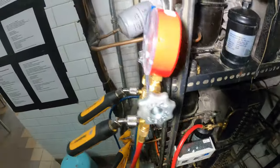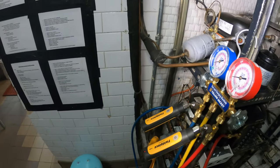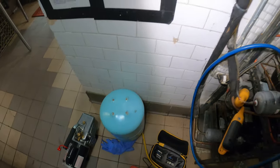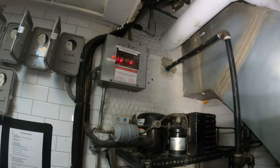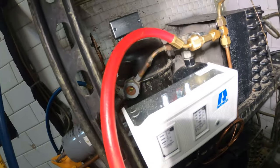Just turned the system on, going to charge it up. I have my manifold gauges and also my digital probes. This is a split system and we're going to charge it with superheat and subcooling. From here, pretty much we just need to get the charge right and adjust the control. I do have videos on how to charge refrigerant using a scale, and I will be coming out with a video on how to charge using superheat and subcooling, along with how to adjust a dual pressure control. If anyone found this video interesting or helpful, please drop a like, comment, and subscribe — and I'll catch you all next time.